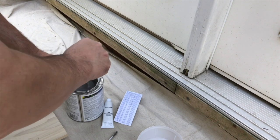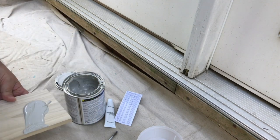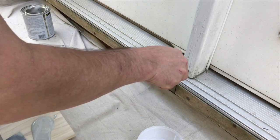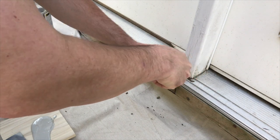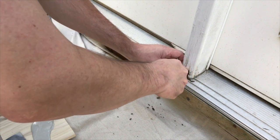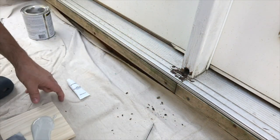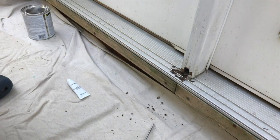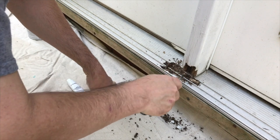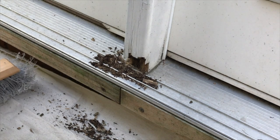One thing I do want to do is remove all of the wood that is actually rotted — go ahead and get that out. I haven't mixed my Bondo yet so I'm good there. I'll get it out of the way so it doesn't get any wood in it. A lot of this rotten wood here — I do want to make sure that we're attaching to good wood.